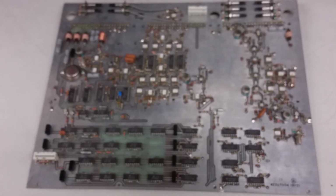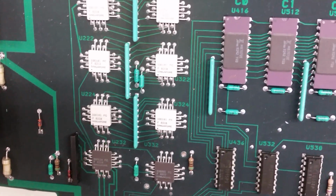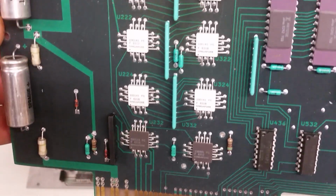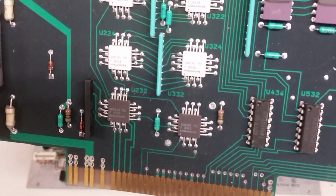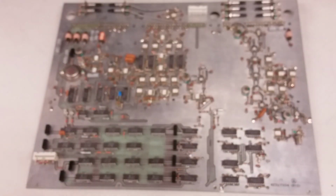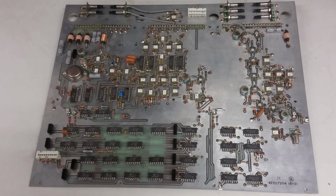Yeah. And oh yeah, I should say that sometimes you would find 100K in these nifty flat packs. This is actually out of some tech equipment, and I don't know what, but it sort of looks logic analyzer-y. But yeah, that's early surface mount 10K there. Anyway, ramble. The point of this video is not to mourn the loss of ECL because no one uses it. Also because you could probably fry an egg on those 100K chips. They suck power like you wouldn't believe.